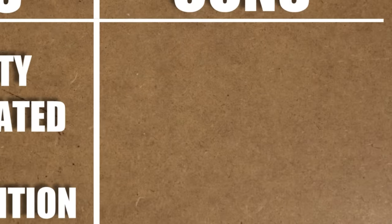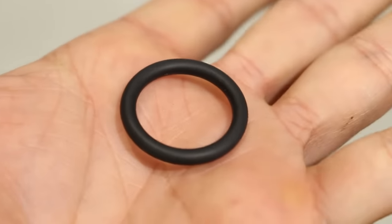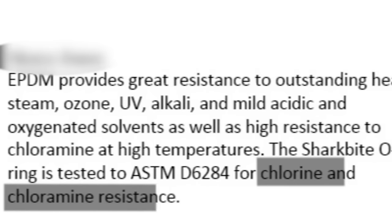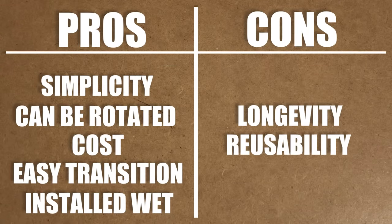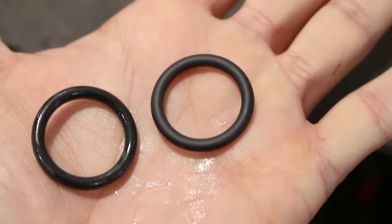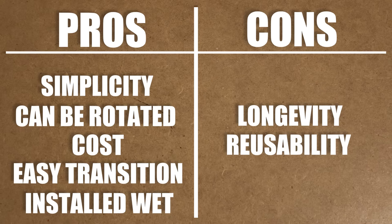Now onto the cons. The first one is the o-ring and its longevity. These EPDM o-rings are made to last a long time if installed correctly, but the fact that they've only been on the market for 20 years remains a talking point. A SharkBite rep confirmed the o-rings are resistant to chlorine and chloramine, but it still doesn't answer how long they will last. The second con is that while they are reusable, it's only to a certain extent. The o-ring inside is lubricated to prevent it from rolling out of place, but by reusing a fitting four or five times, this lubricant wears off and could cause the o-ring to come out and leak. If that happens, the o-ring can't be swapped out like with John Guest fittings, so the fitting is basically no good anymore.